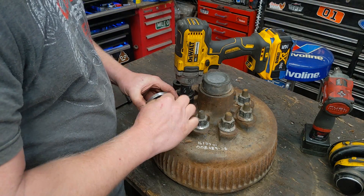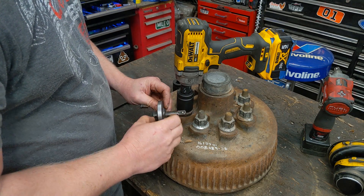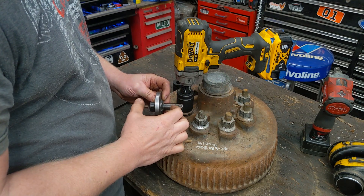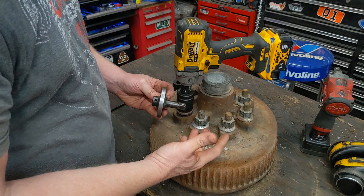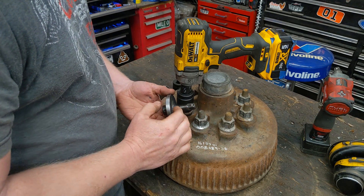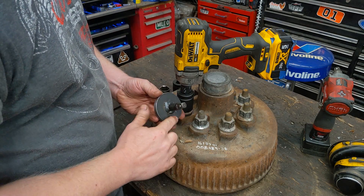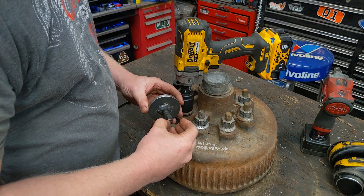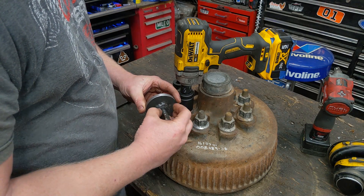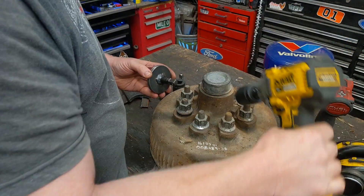So that's just flexing and causing a lot of heat in the metal. It could be it might've been better to put the weight down closer to the socket. I don't have any super stubby extensions laying around, so I'm going to make my own. I'm going to trim that off, leave this weld on the back, and then weld the male section — the half-inch — just down against it so it's just a really short stubby. Then we'll try it again.